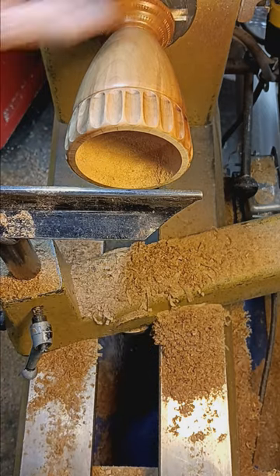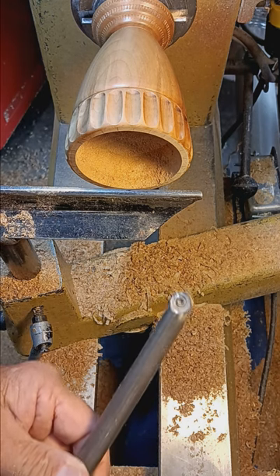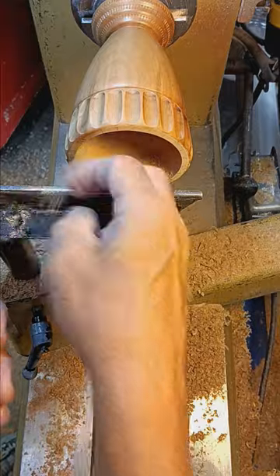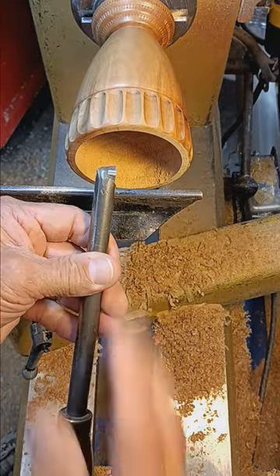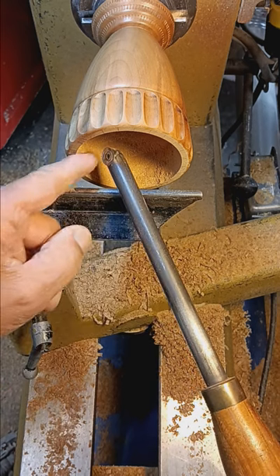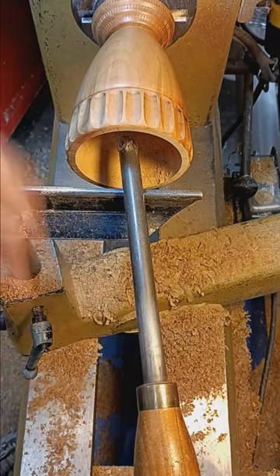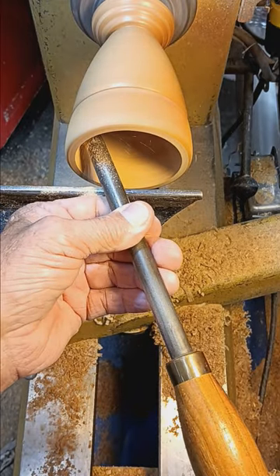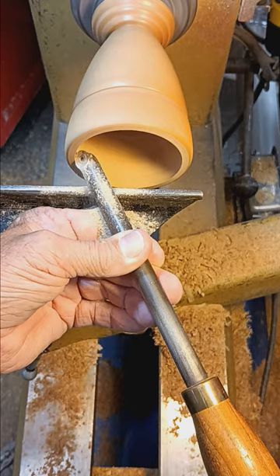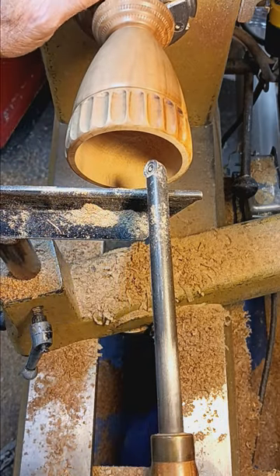Sorry about that. Another tool that I use to finish off my box interiors or my vessels is a Hunter No. 5 tool. This is an older one — it was originally called a No. 4, but they changed the name on it. The tool's mounted flat. You never use that tool in this position; it will grab on you big time. You always use it like this. By swinging the tool out, I'm actually shear cutting. To go across the bottom of the vessel, I go in there and find the bevel. I'll show you how it's used as a shear scraper. And by cutting it carefully, I can get a really clean cut on there — shear scrape.